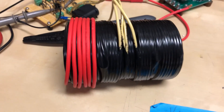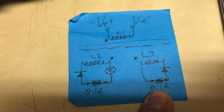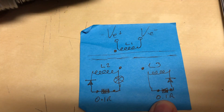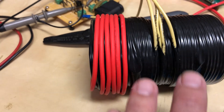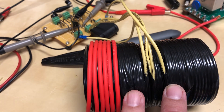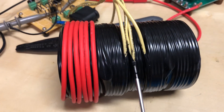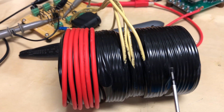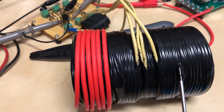I'm still working on this asymmetrical gating setup. I've got a nice sawtooth wave on one side of the circuit, which just has the diode and the resistor. I made this coil from a bunch of toroids placed together. The whole length of wire is 16.2 meters, so I cut that in half and wound half on each side — one coil wound in one direction on the first layer, then continuing back the same direction.